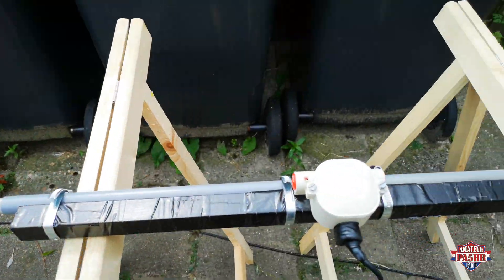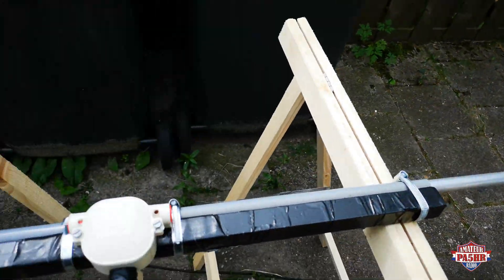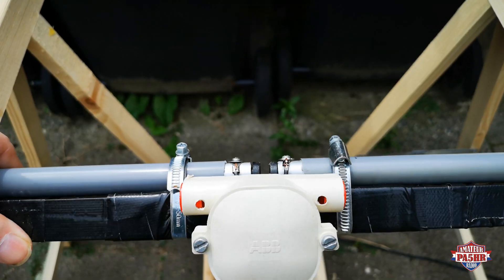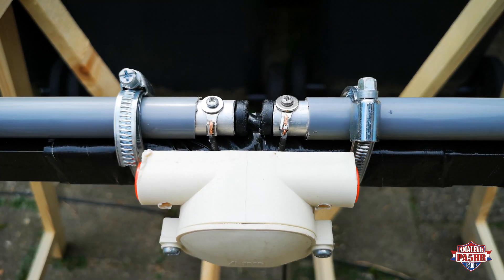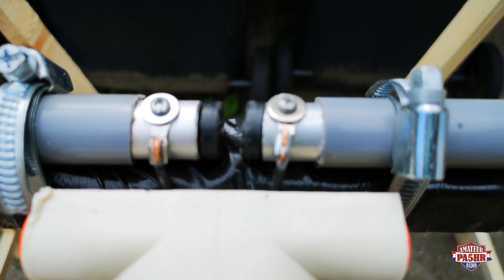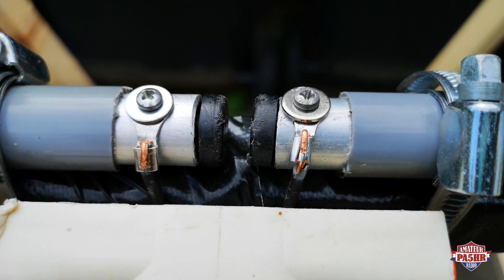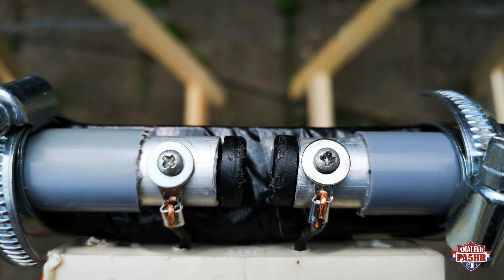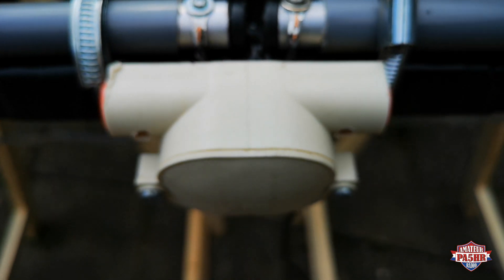This is the connection point I have made, and you will see - that is the whole antenna with the coils. Here is a connection point, you can see that left and right. I have made a little coax balun - it's inside the box here - and then I go to the element left and right.